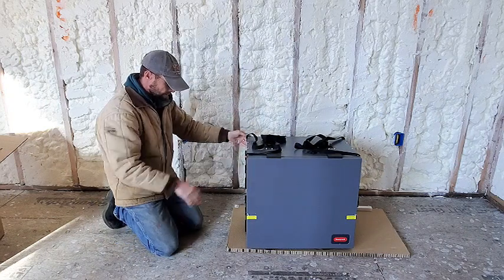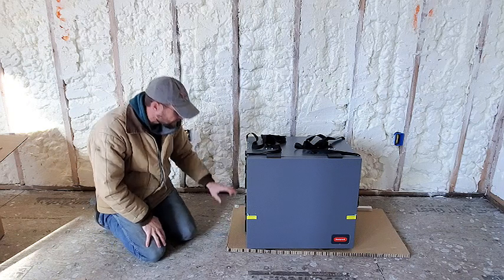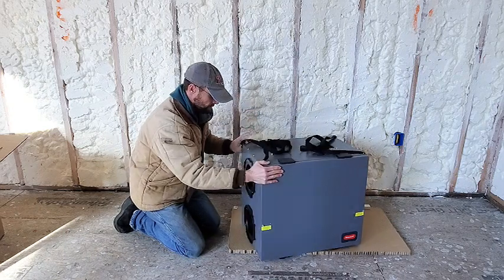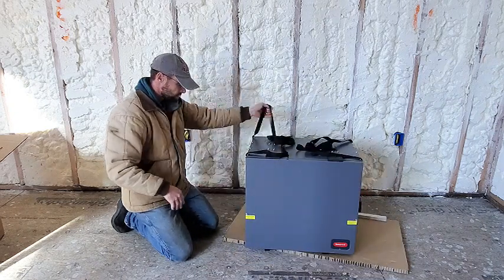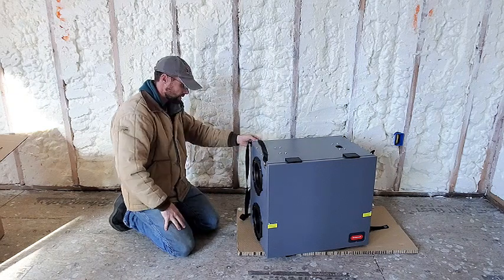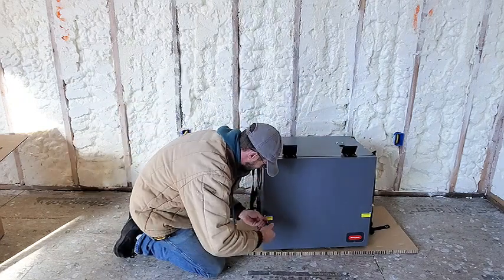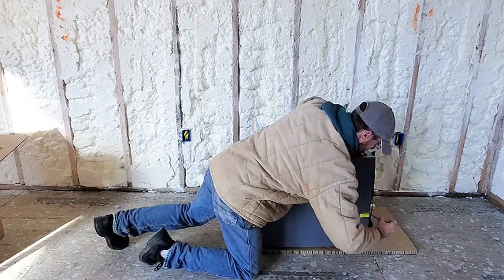There's a whole lot to it. We've got air coming in from one side - this says fresh air from outside, so this will be my inlet. This is exhaust air to outside. Air will come in here, cross over a filter, and go to the inside. The inside air will be drawn into this top part, across the filter, and then out. There are these intakes on either side here. I'll open it up - there should be some boots that come off here to attach your ducting to, and hopefully those will be inside.